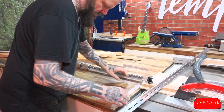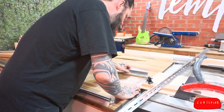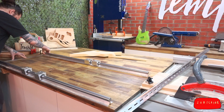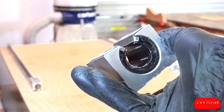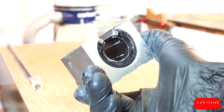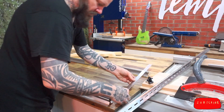The basis of this jig is these two linear steel rails with four matching bearings. The rails are 1.5 meters long, and the whole shebang cost me just under 200 Australian dollars. You can make the same thing out of wood if you like, and I will include plans for just that in the description. But for me, this tool is going to be multi-use, so I'm going full Trent Reznor with it. The bearings have M6 sized tapped mounting holes in the top, and they can only move along one axis — wherever the rail is pointed. The concept is to mount the workpiece between the rails at a minimum distance of the width of my Conquistador guitar body, plus the distance from the edge of my router bit to the edge of the closest bearing on each side.